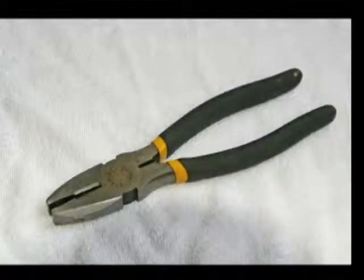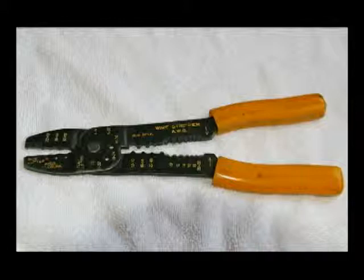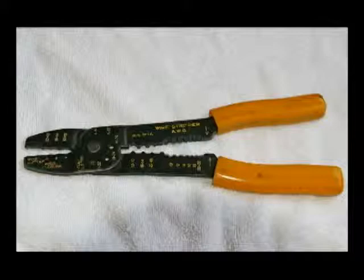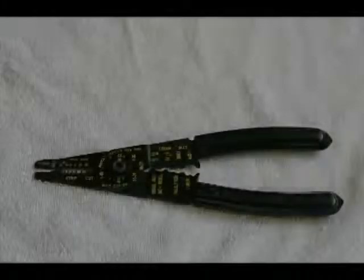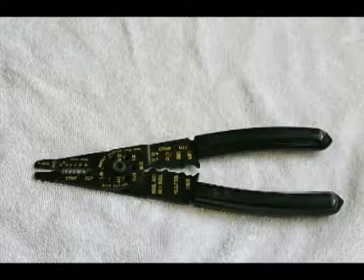These are electrician's pliers. They have insulated handles, they also cut wire, and they have a big, wide, long jaw to enable you to twist wires easier than with a standard pair of pliers. These are not necessary but nice to have. The tool shown here cuts wire, crimps both insulated and uninsulated terminals, also cuts small threaded screws, and strips wire. This tool did all that the previous tool did, but it also has a small pair of plier jaws on the tip of this tool.